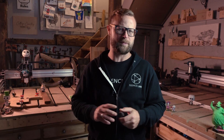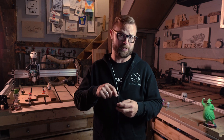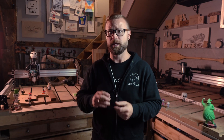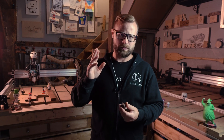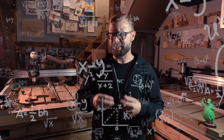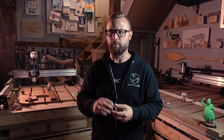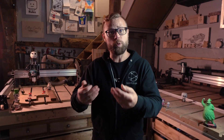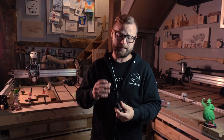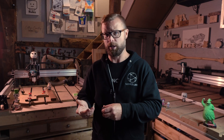As far as carving these goes, I was originally planning on using two different bits — an end mill and a V-bit — the V-bit to get into the tiny details, and the end mill to clear out the pockets. My thinking was it would be faster for the end mill to clear those pockets. But when I started doing the math on my prototype, there are two bit changes per side, six sides on each die, and I want to make a set of six. That was going to be an absolute huge amount of bit changes, leading to a larger margin of error. While the V-bits are slower to clear out those pockets, it's a lot faster than doing a whole bunch of bit changes. So unlike our tombstone video where we purposely showed the benefits of bit changes, here I went out of my way not to do bit changes.